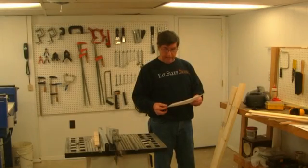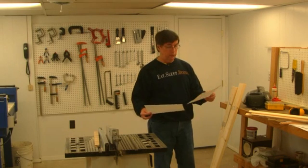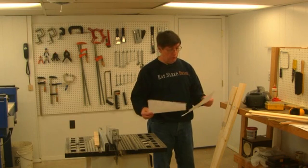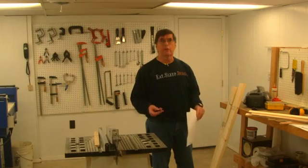Next we have the rail base side enclosure parts. We'll cut these down to a two by two, and also the rail base enclosure parts — they're very similar. One is 48 inches long and another is 45 inches long, so we'll rip these out of two by fours again to get them down to two by twos.